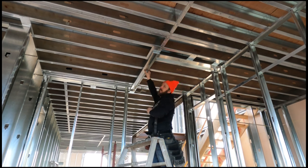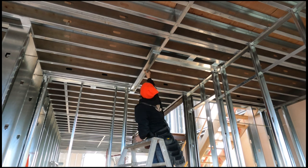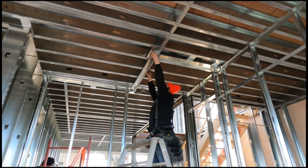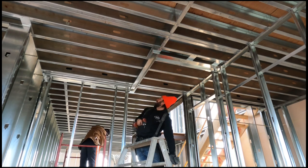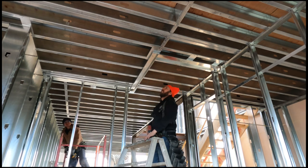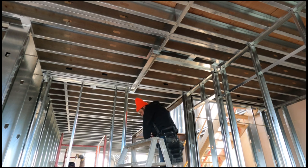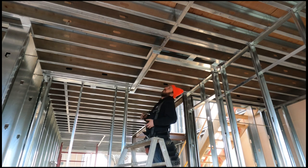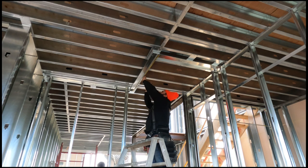When you're drawing your centers, you know the walls you've already framed are level. So when doing your 16, 32, 48 layout, just pull your tape like you did on the bottom. If you have half-inch drywall on that wall, come out 16 and a half to your first stud center. If you're coming in from an outside corner, come in about a quarter inch — you always want a quarter-inch stagger for normal corners. For bullnose corners you need about half inch on each side.